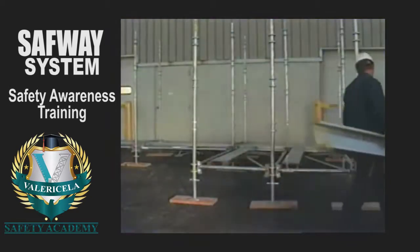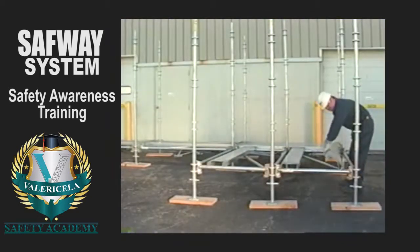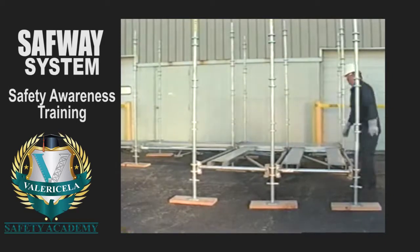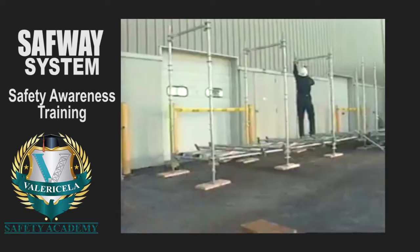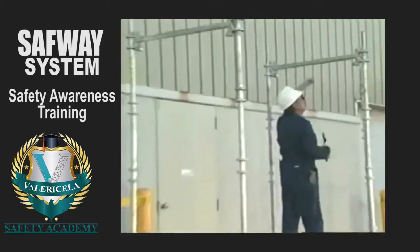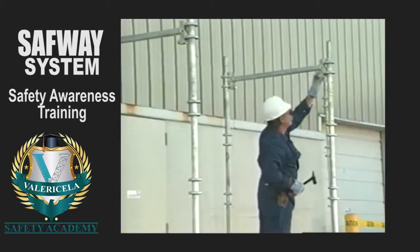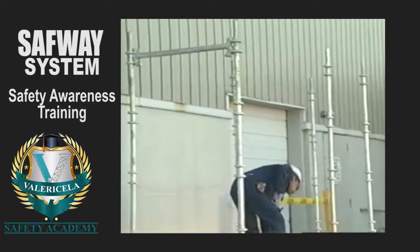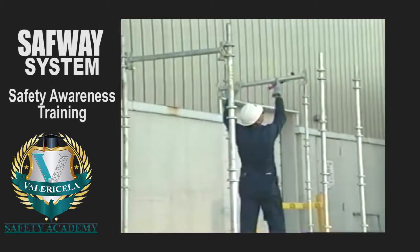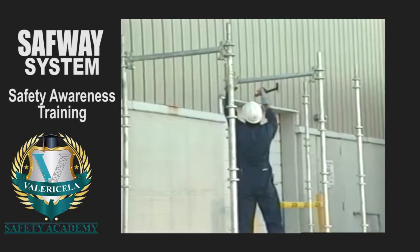Install at least 2 scaffold grade or metal work planks on the scaffold deck on the base level bearers. This will help make working on the next level easier and faster. Counting up a maximum of 4 ring sets, the next level of horizontal runners and bearers are installed. Working from below and within the scaffold, drive each wedge home until the locking retainer drops, securing the wedge.